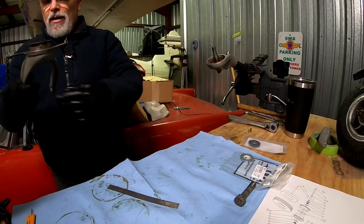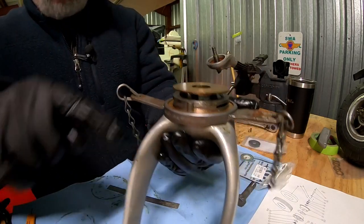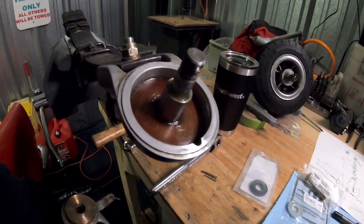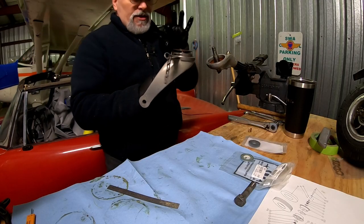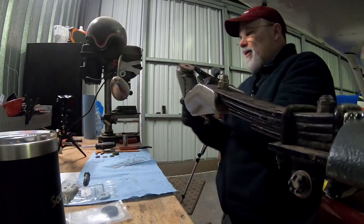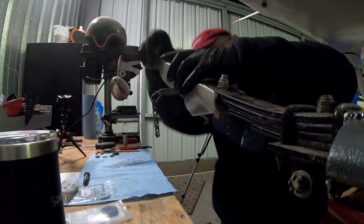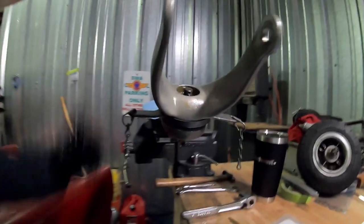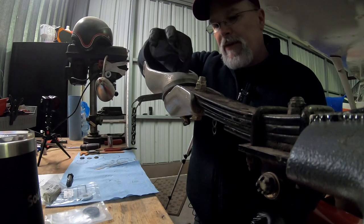So we'll have something like that. What we're interested in is that paw that you want to make sure is facing down. That paw is going to go into the back and put that paw right in that little notch on the back of the headstock. Now that we've got the springs, you don't have to mess around with trying to balance all the springs. We're just going to set this right over the top of the pinion. What we're looking for is that paw just to go in and engage right into that little notch. So we're gonna take our bearing and put her right there.